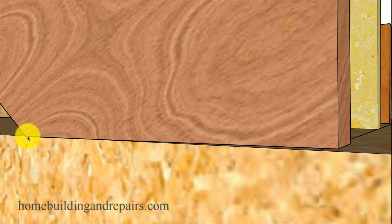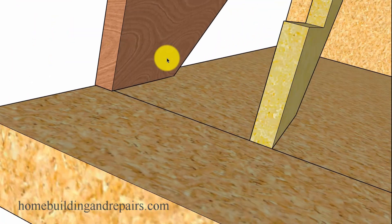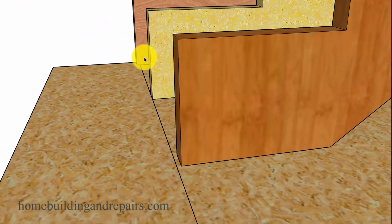Here we have a gap at the front and it's tight at the back of this one. Even though we haven't changed our tread measurements — these are exactly 10 inches — it's going to push this out a little bit. These are computer-aided drawings and they're usually not wrong. This is something I remember running into on job sites: if I didn't cut the stringer the right height, if I didn't figure out the risers correctly — precisely, exactly precise measurements for the risers.